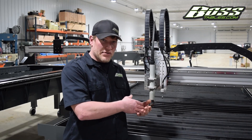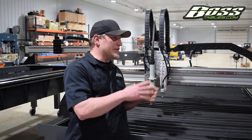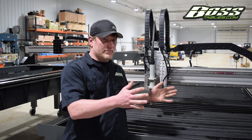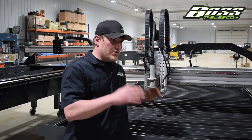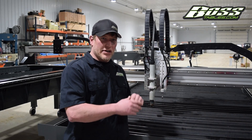Just go back to the beginning and make sure in CAM that you have the correct material and correct consumables chosen, and make sure the tool is correct. We've had guys call and say they're running 125 amps on eighth inch — you can if you make a custom tool, but you're way outside the cut charts. Especially when you're just starting, don't go crazy. Do what's in the book and you're going to have good, consistent results.